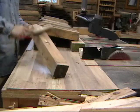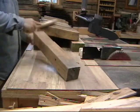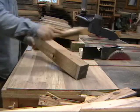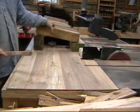Grab all the 4x4 pieces you can if you're going to make this bench. The longest pieces are only four feet long — you won't have trouble finding those. But also grab all those short foot, foot-and-a-half 4x4 pieces; those are going to make our top. When you're using this kind of wood, it all comes down to the milling. You're going to be spending a lot of time on your jointer and planer, so take out a wire brush and clean as much of the dirt and grit as you can off all the sides of the boards.